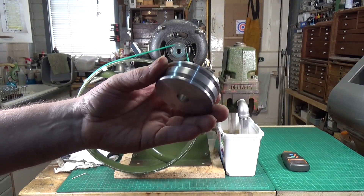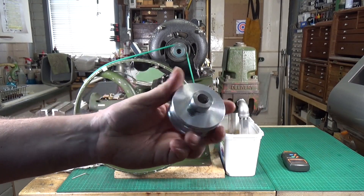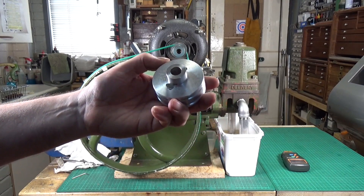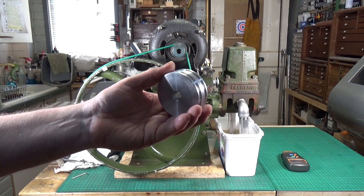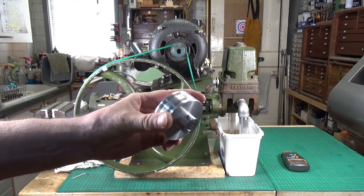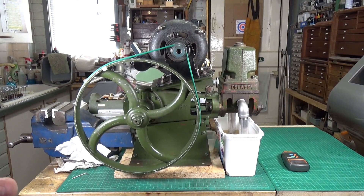This will do fine — I'm very pleased with it. It just shows you what you can do: this started off life as aluminium extrusion off-cuts, a backyard homemade furnace cast the blank, machined it up, and we've got a perfectly serviceable pulley. I thought we'd check the RPM of the pump with the little tiny pulley that's on there at the moment.